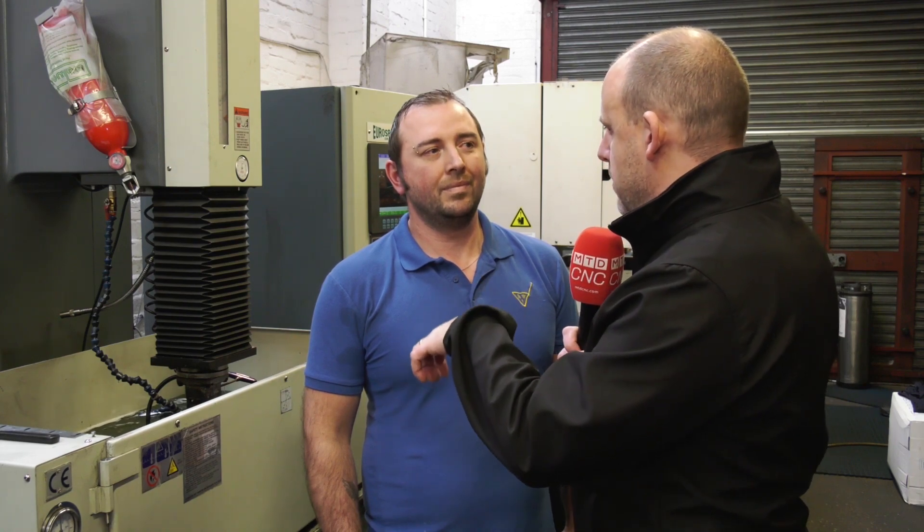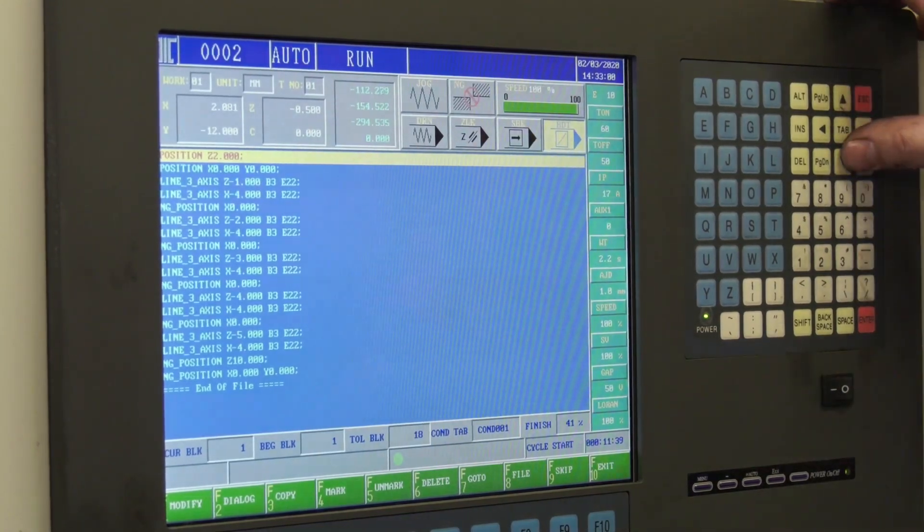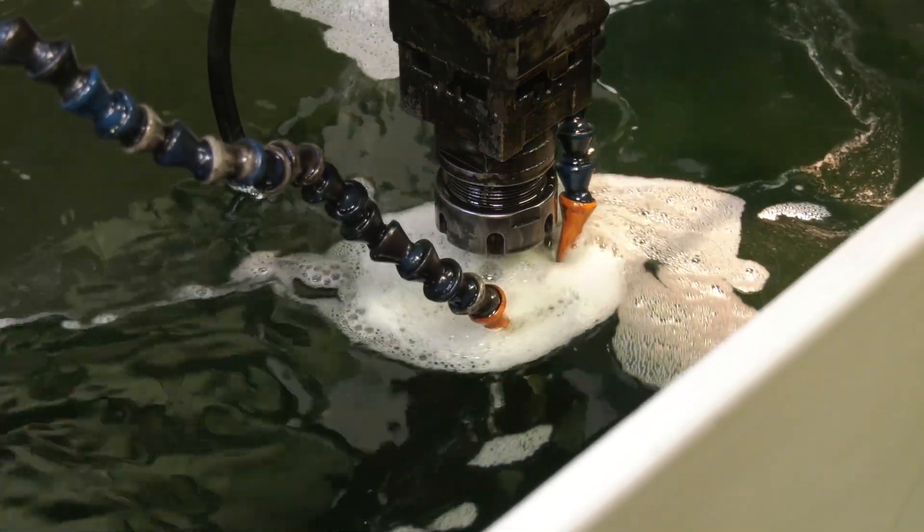Two things on the electrodes — you have form electrodes which means they will cut to a form. How much smaller than the form you need to cut does the electrode have to be on a machine like this? Realistically, it depends on how much power you actually put through it. If you're cutting at low amps, you'll probably get away with smaller spark gaps, closer to actual size. If you're cranking the amps up to around 50, then you'd be cutting between 0.3 and 0.5mm on the spark gap — you've just got to bring all that into consideration when you're making your electrodes.